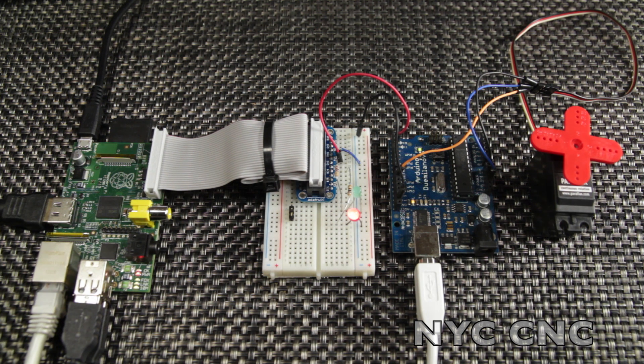There was a lot of information on websites about integrating Arduinos with Raspberry Pis using serial protocol and some more complicated stuff. Maybe it's not that complicated, but it seemed complicated to me. So I thought, wait a minute — I can use digital pins on an Arduino to read whether something is high or low. And the way this project works with the Raspberry Pi is when the LED lights up, that pin is pulled high.